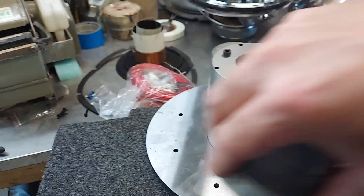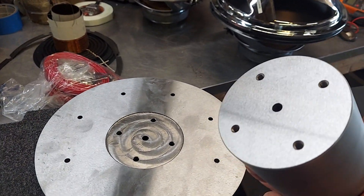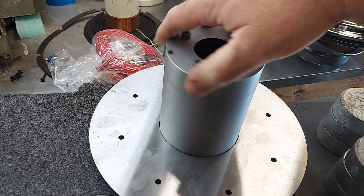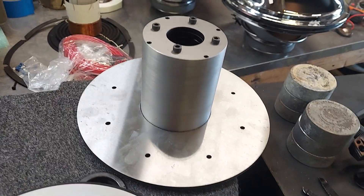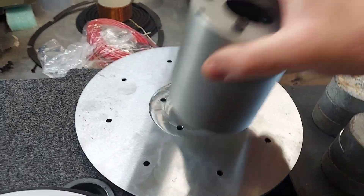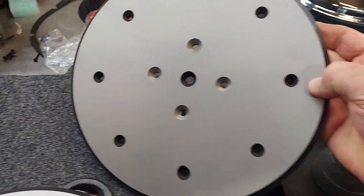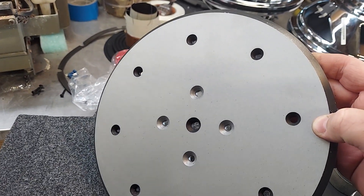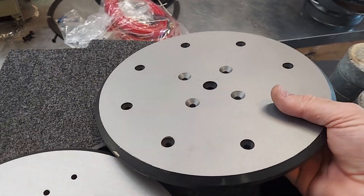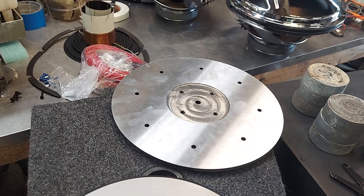Since then they've made much bigger magnetizers so they can use much different magnets. I'll take this apart real quick. This originally just had a single hole in the back; I had the boys add four more, then had them mill out the center part to make good metal-to-metal contact. You really only have to get it in close proximity for it to be effective, but that's the OCD in me. I had them spray painted black, then put on the surface grinder — it ended up looking really cool. That's also known as diamond cutting — you sometimes see that on subwoofer frames.